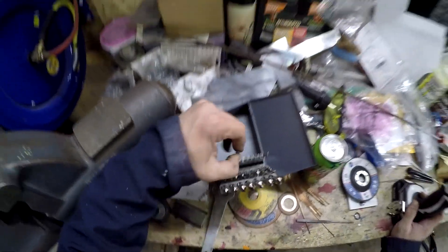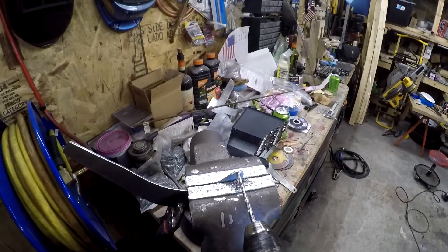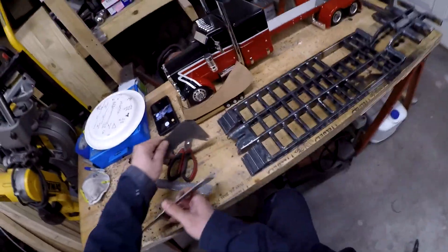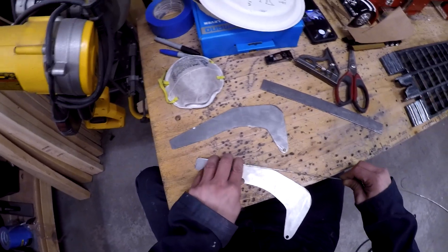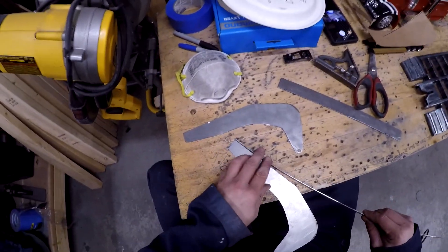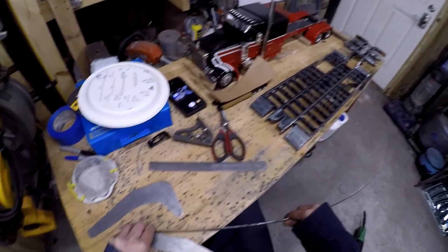Two, four, six - okay, so a two and five-sixteenths inch hole. That pin will go through there and I'll be able to go and pick that up. I want to make these C-channels just like the rest of my frame. I've got this strip - it was again from the center of the one-inch piece I cut out.